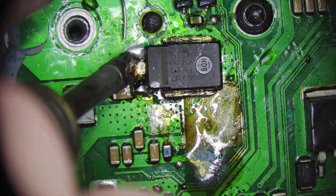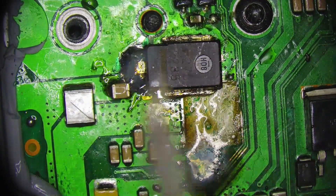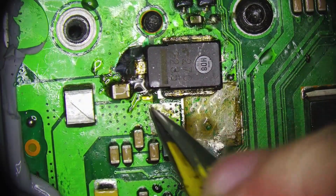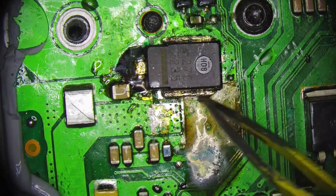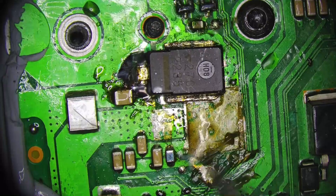I'm just going to add a ton of solder here to help fix that crack that was there. The good news is this is fixed, and it will not happen again. Because now if the TVS diode blows out it's just going to be a pure short — there's no way this is going to split open again. I guess it could do it right here, but it probably won't. It will probably be more like the 06 ones where that part doesn't go bad — just the TVS diode shorts out and then it blows fuses in your truck, which is good.